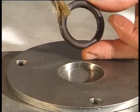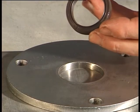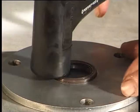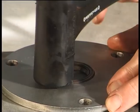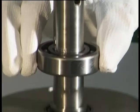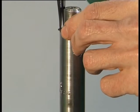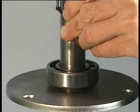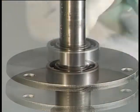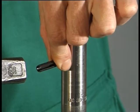Grease the radial packing ring as specified in the lubrication schedule. Fit the radial packing ring in the bearing cover; the part number of the bearing cover must face upwards. Drive the radial packing ring evenly into the bearing cover by lightly hammering with a mallet. The fitted radial packing ring must protrude above the surface of the bearing cover by 1.5 to 2mm. Place the bearing cover with fitted radial packing ring on the spindle with the part number facing downwards. Heat the groove ball bearing in oil to 80 degrees centigrade (176 degrees Fahrenheit). Slide it onto the spindle and carefully drive it up to the bearing cover using a suitable pipe. The pipe may only contact the inner ring of the groove ball bearing. Fit the retaining ring and lock the groove ball bearing with the retaining ring. Drive in the dowel pin; the protruding ends must be equal on both sides.